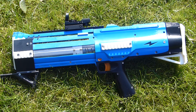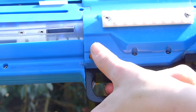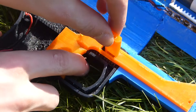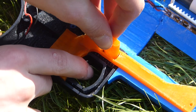Because this gun is quite powerful, I added a safety switch. It is a button which can be pushed from either side to lock or unlock the trigger, similar to how a drill's safety switch works. There is a hole in the trigger arm which the safety switch slides through. When in the unlocked position, there is a slot cut which allows the trigger to move. When locked, it obstructs the trigger travel.